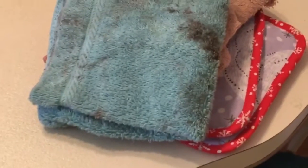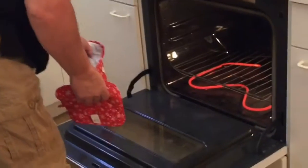Now I'm going to check it. I want it nice and soft. That's a 350-degree oven, and this plastic melts at 350 degrees. So Lexan or acrylic is approximately a 350-degree melting temperature. Make sure you have lots of pot holders and so forth ready for the thermoforming, because that sheet's going to be hot and we don't want to burn our hands. All right, that's a good video. Pretty soft. I'm taking it out.